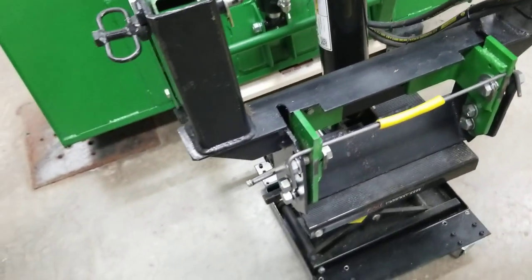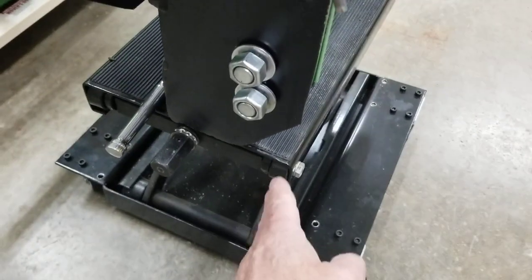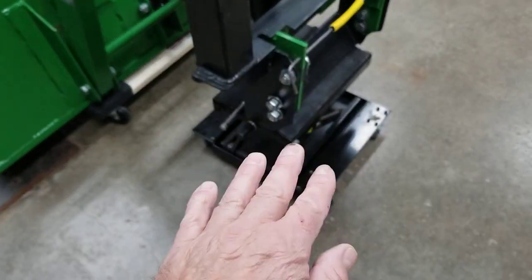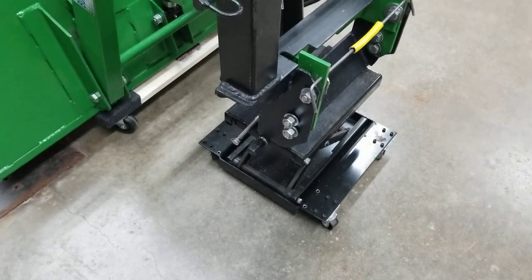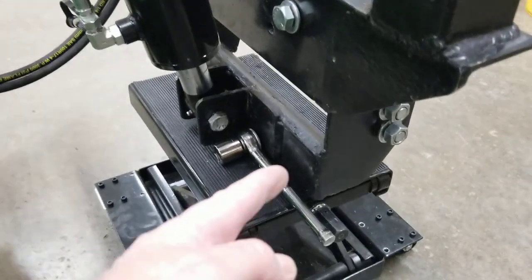This is also on a rolling motorcycle dolly, so I take this whole thing and slide it up to the front of the tractor. Take this crank jack and let it down to it. Slide in the green plates which bring the bolts out, and all I've got to do is spin on three nuts in the back and one on the front on each side.